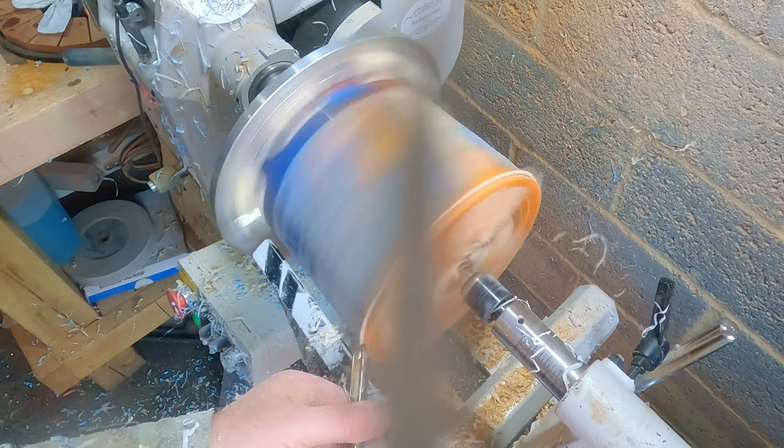Completely remove the shiny low spots and cut down into the outer layers. I used a freshly sharpened bowl gouge to remove around 1/8 of an inch of material. I found the trick here is high RPMs and firm, constant pressure, allowing the blade to do all the work.